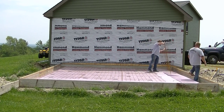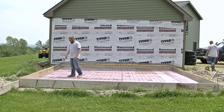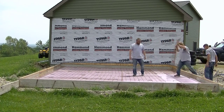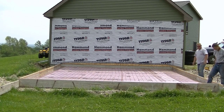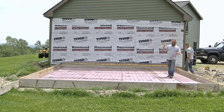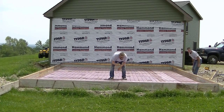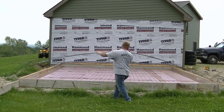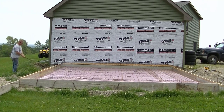We're using light gauge wire mesh — 5-foot by 10-foot sheets at about $7 each, around 12 sheets total. We're also putting a double row of rebar around the outside edge to beef it up. The full styrofoam sheets are 4x8 and easy to lay; I had to cut strips for the tapered edges. We'll lay the rebar on the outside edge and wet-set it when we pour so it stays 2-3 inches from the surface.